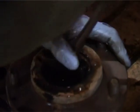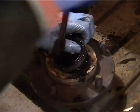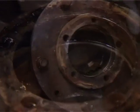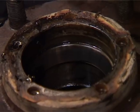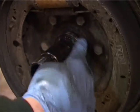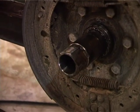On the rears with drums you've got two seals — you've got an inner and outer seal on the inner and outer bearings, obviously. Let's clean out the bearing races and have a look at them — that's the messy job. This is the inner seal, which goes on the inner bearing, which is the inside of the hub, which will sit like that with the lip protruding upwards, which the lip will run on the outer part of the stub axle there, stopping the oil going anywhere.